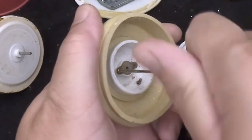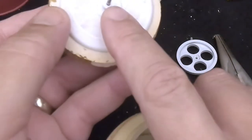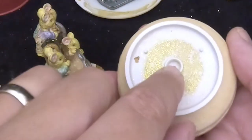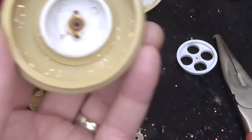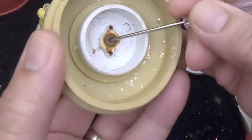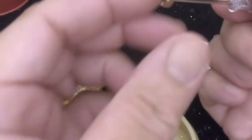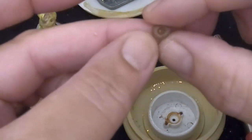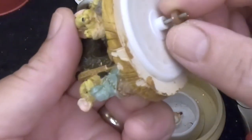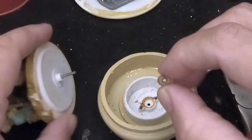This piece here — I think it's supposed to make a seal around the shaft of the figurine, because the shaft which is inside the globe goes through the stopper. The only thing stopping water from leaking out is a rubber O-ring in here. When you tighten the plate down on the O-ring, it squeezes against the shaft to keep water from leaking out. This might have been too tight, which would also cause binding. We'll reassemble after cleaning and make sure nothing is too tight.